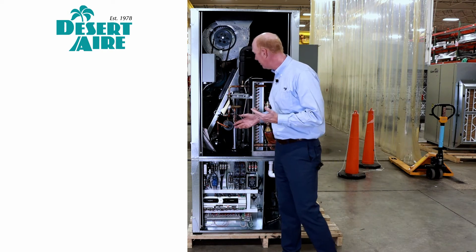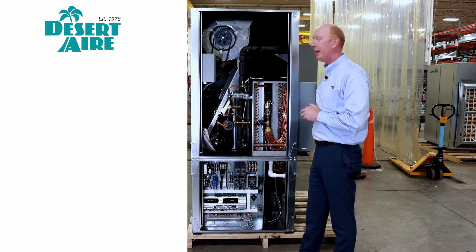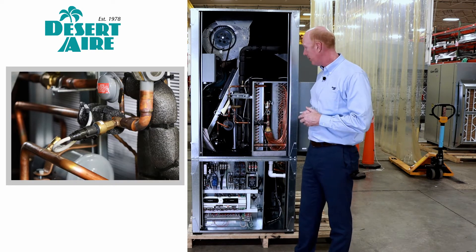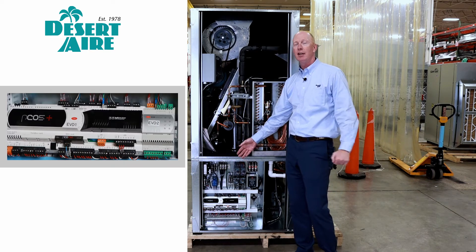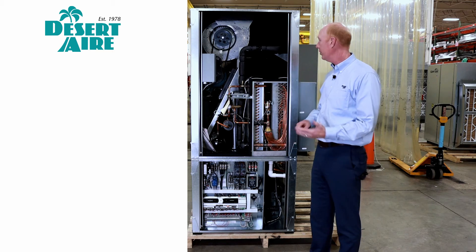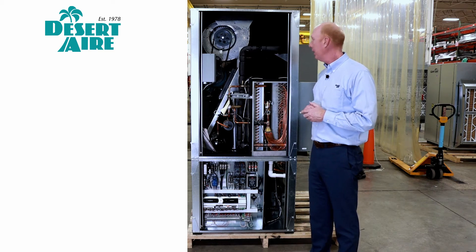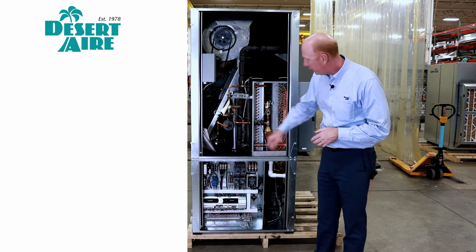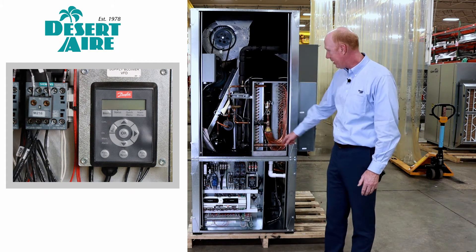Some of the things you're going to see in this unit are nice clean piping, utilizing our pipe bender and minimizing braze joints. You're going to see pressure transducers for suction pressure and discharge pressure. Down on the electrical panel, you've got a full DDC controller that is going to monitor all kinds of points for you. We're going to have airflow by way of a differential pressure transmitter across that reheat coil, equated to airflow and so forth. We also have a voltage monitor on this unit, and the VFD remote keypad is here inside the electrical panel.